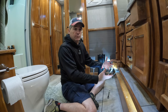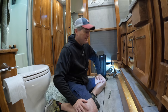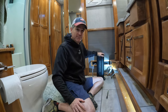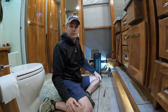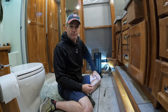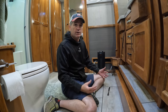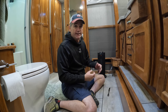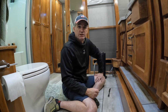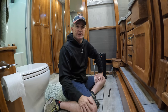The more you do to insulate and make your unit more efficient, the better off you'll be. Getting back to the space heater — $65, we have one here and one in the other room, and we'll run that until we go to sleep. The reason it's important to run your furnace is because all of your plumbing is down in your basement. Your furnace is designed to heat all that — to keep your pipes from freezing, cracking, and expanding. Always run your propane. We kind of use it all as a system together and it works out good.